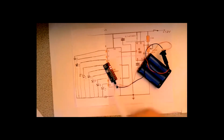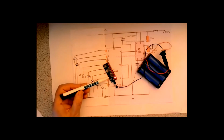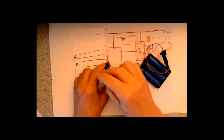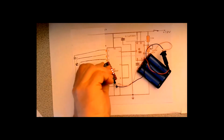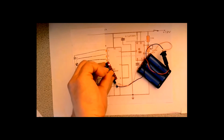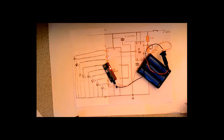And again, you can see hopefully a chip down here, surface mount, that's the 555. That chip there, that's the 4017. Only one lights at a time. It's got a trimmer and we can use that. They go very fast. Try and get out of the way here. To have different speeds. So as it stands, that's all it does.